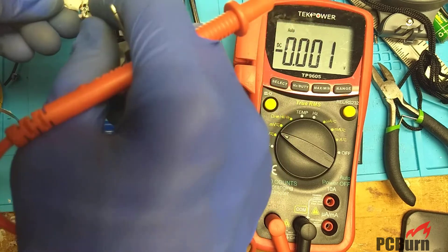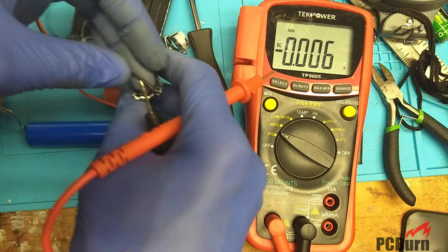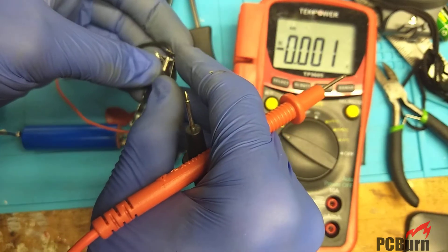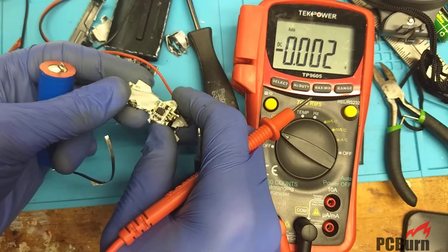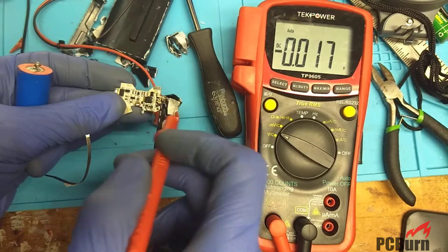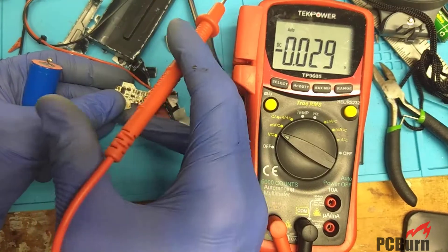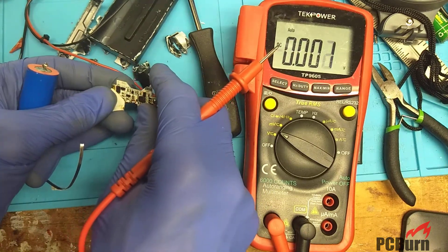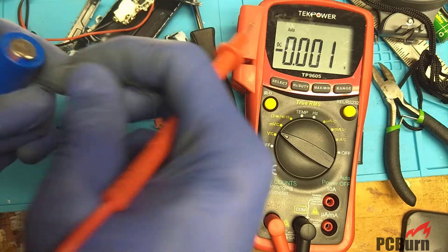I don't know what was going on, but something might have gone wrong when I soldered some leads to the little barrel jack connectors that were internal on this battery. Maybe one came decoupled slightly, although why it would then put two volts on it, I don't know. The HM8202 charge circuit actually looks fairly normal — I looked it up and that's a fairly standard chip with okay build quality. This battery hasn't really seen much use; I used it briefly to test some equipment and then it sat on the shelf mostly charged.